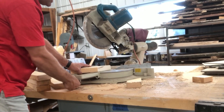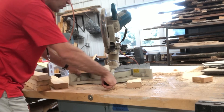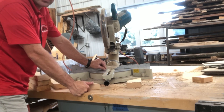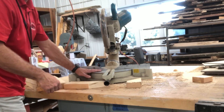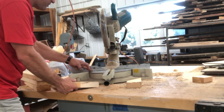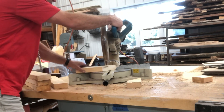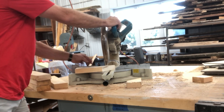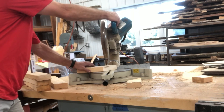Another tip: you don't want to have a piece of lumber so short that you have to hold it really close to the blade. If you have a piece of trim or scrap that you have to hold really close, there's a better way — use a hand saw. Make sure when you use this saw that you're holding the wood tight against the back fence, with no debris back there. Push the lumber tight against the fence; if there's a gap, the saw will push it, hurting the blade and possibly hurting you.